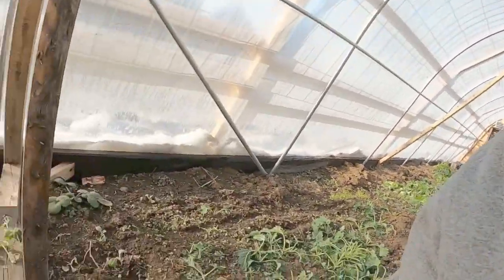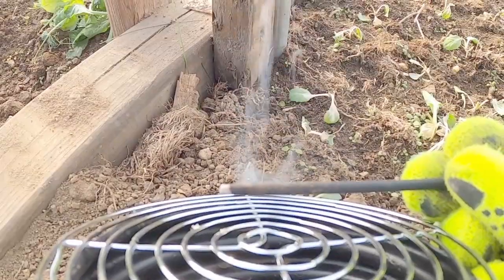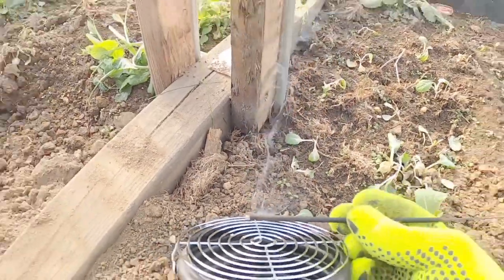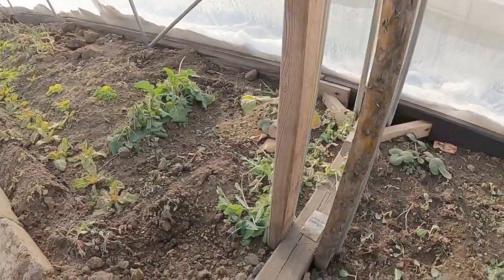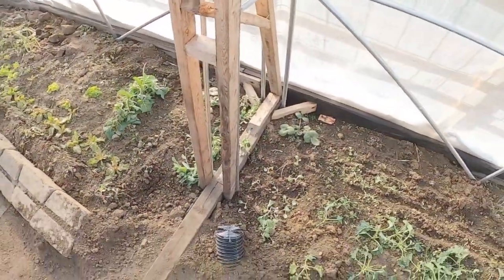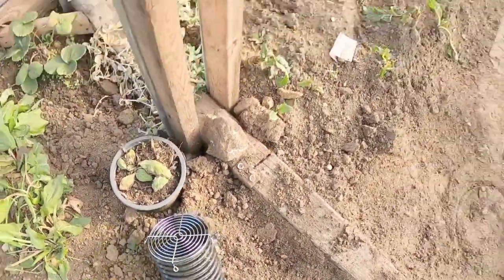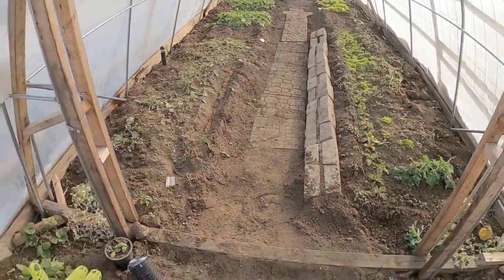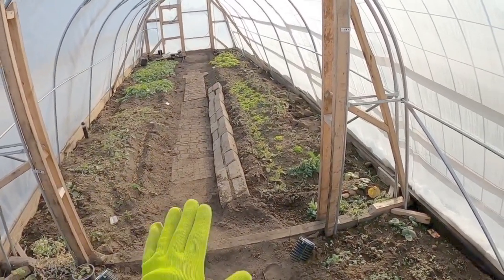We're doing pretty well with our little solar panel and solar fan running our geothermal. I just wanted to show some flow on a decently good day for solar activity — it's definitely blowing some good air into the greenhouse. This little hose and this little hose are pumping out some good airflow, enough to aid in heating the greenhouse. Having 50-degree air coming out of the floor first thing in the morning is better than nothing.